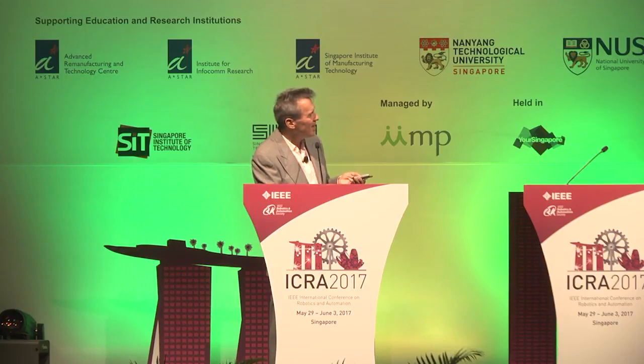And on the right-hand side, you see the advantage of, in this case, a pneumatically driven robot, meaning we don't have any electric parts. So even when this robotic arm is catching water drops and you have water all over the place, your system will not fail. This is the big advantage of fluid technology, where you don't have electricity on the external parts.